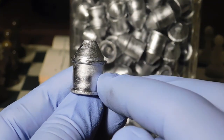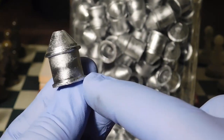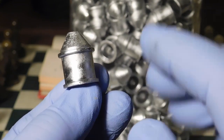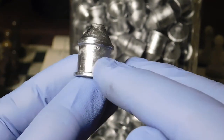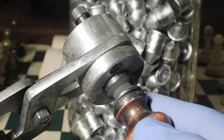The tin is important to lower the surface tension and allow the detail to fill out — it doesn't take much. So with some tin and 875 to 900 degrees Fahrenheit, we get good alloy.